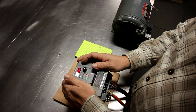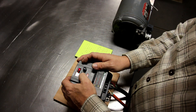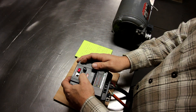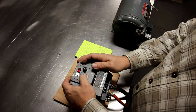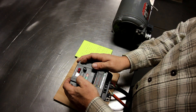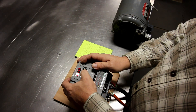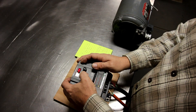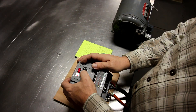I'm not going to go into real detail about all of these parameters, but basically what I set up was: I wanted to use the potentiometer that's on the pad — it doesn't come configured that way, so I had to set that parameter — then set the frequency limit, the Hertz limit, acceleration and deceleration time, the rated motor RPM, the rated amperage for the motor, the voltage for the motor, and the carrier frequency and carrier mode.